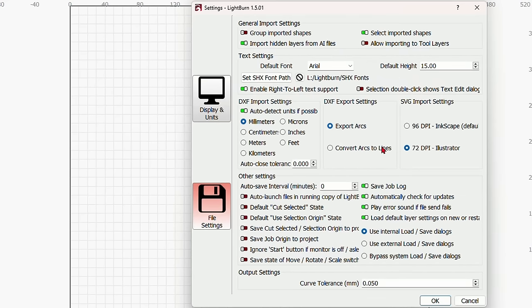So now that we've got the two of these done, going back to LightBurn, we've got both of these done, and what I'm going to do is just move this one. Now I'm going to leave this one here, because this is the next one that we're going to do in current position. So over here on the laser tab, I'm going to change this from absolute coordinates to current position. And we can work any way that we want. We can do anything that we want on here while this job is running.